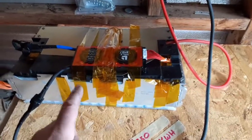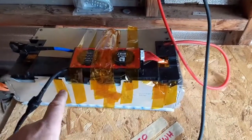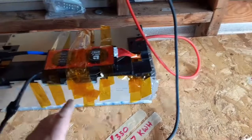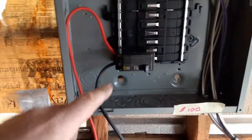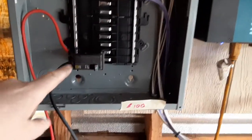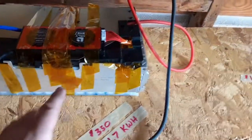The reason this system only runs off one battery is I only run this during the daytime when I'm working in the shop, so I don't need a big bank or to run it all night. This battery is rated for high input and output because it's an EV battery, so it can handle the juice when a cloud passes the sun. It's on a 40-amp breaker with a 60-amp BMS — double protected. At 40 amps, that's 2000 watts going into the inverter, so it's limited right here to 2000, even though the inverter is rated for 3000, and it's never going to reach anywhere near its full output capacity.